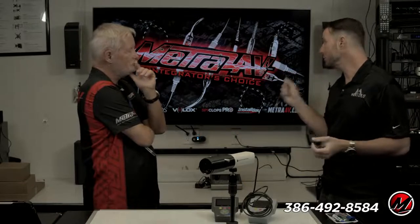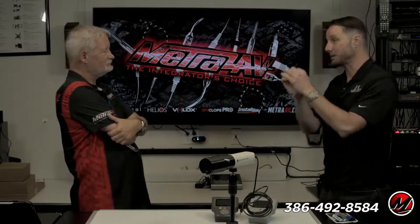Exactly, exactly. So when we're talking about content right now, what we commonly refer to are really the big three: 1,000 nits, 4,000 nits, 10,000 nits. So a lot of people are like, oh my God, 10,000 nits, that's going to blind somebody. The whole picture isn't 10,000 nits. When you see a firework explode on the screen, there might be 10,000 nits worth of content in the middle of that firework for 10 frames, if that.